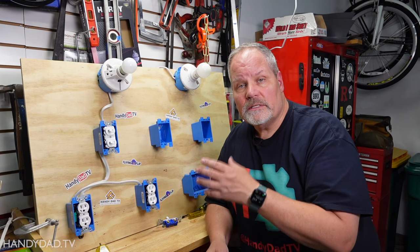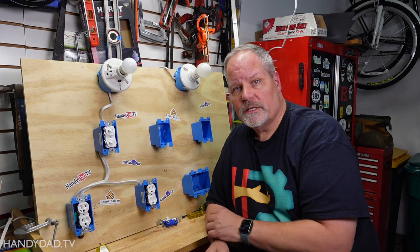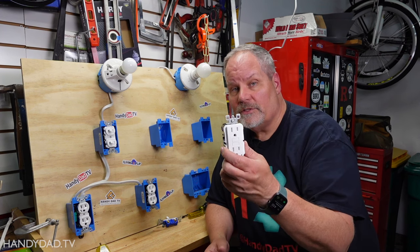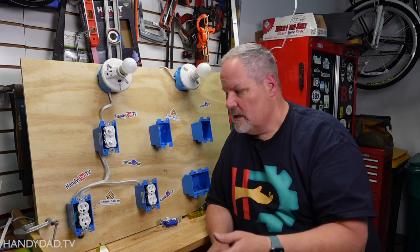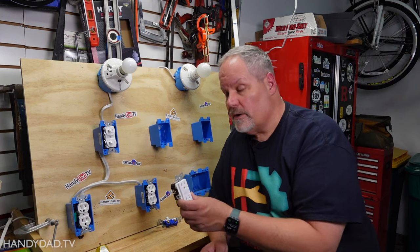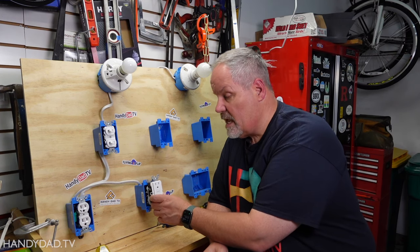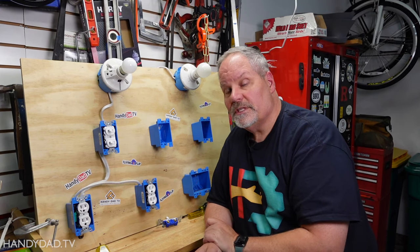The second scenario is let's say you want to do some wiring in your basement and add some outlets. You have to have GFCI protection in a basement because they are subject to flooding. Code requires a GFCI outlet, and in that scenario I'm going to show you how to take this outlet and add other outlets to it that are protected by this one.